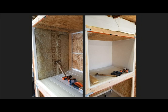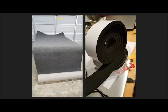Each of the side panels has the acoustic insulation and then a piece of 5/8 inch drywall on top of that. The reason I'm using multiple materials is because each one of these techniques traps a different frequency of sound. The rock wool absorbs certain frequencies better than others, and drywall is actually very good at sound dampening, which is why you see it in homes. Later you'll see the carpet, which is good for high frequency dampening.